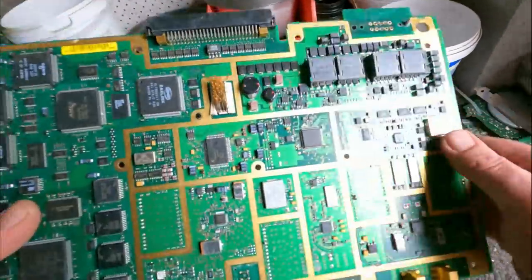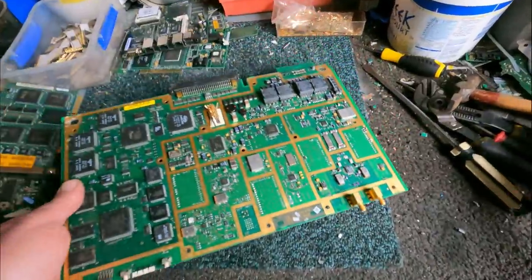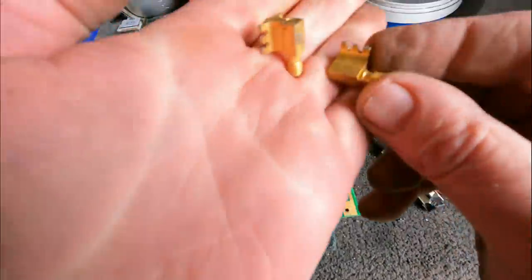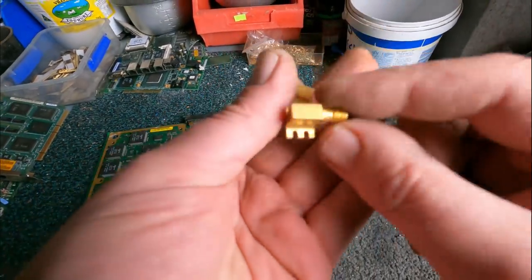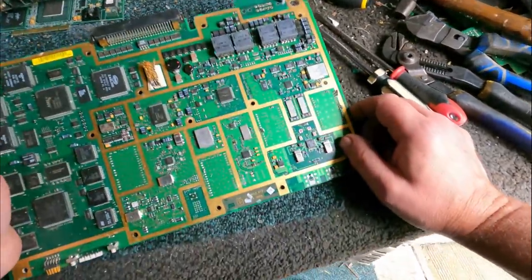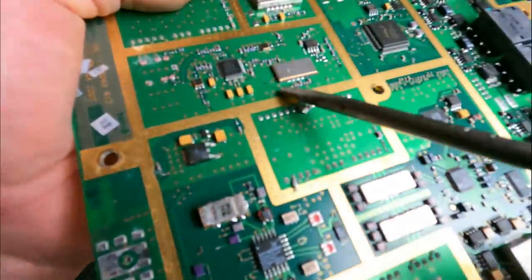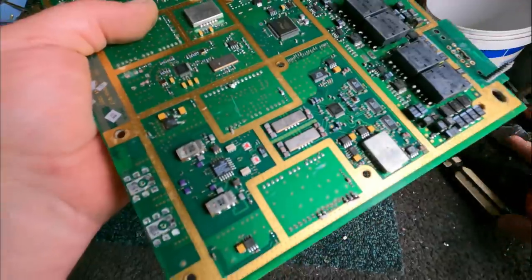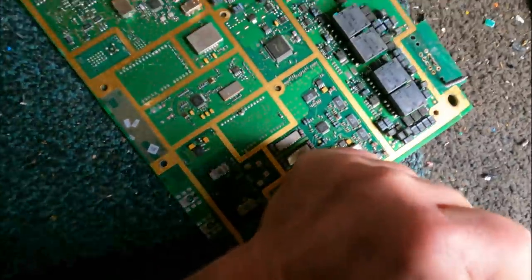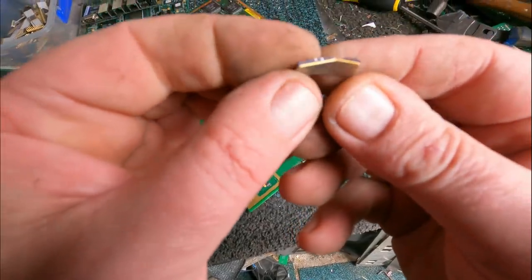We do have gold band crystal oscillators here - but they're really long. Two of them there, and another nice chunky one. Easy to miss if you're just looking at a board like this. So we've removed the cap, got a little bit of ceramic left there, and you can see the gold band around the edge. I'll show you - you can see there's a little die in there, and I can also see a lot of gold plating underneath the die. Tiny gold bonding wires. We want all this including the die.